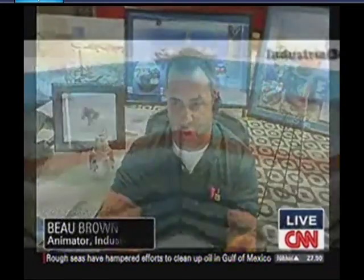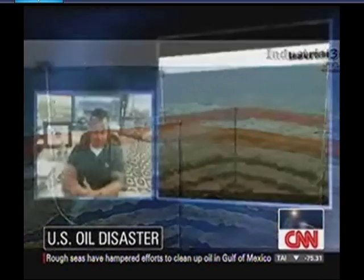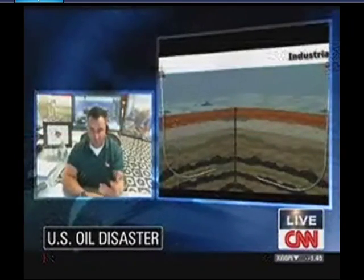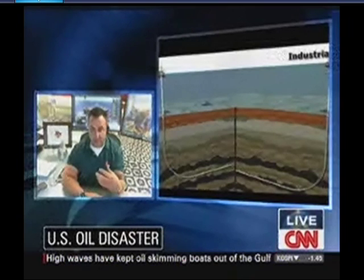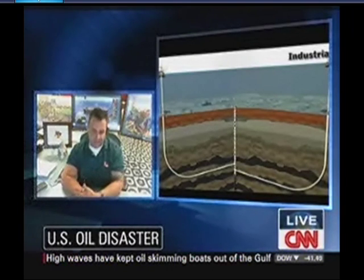Just describe what we're seeing here. Well, you're seeing the two relief wells — they're being redundant, they've got a backup, they're running two. Drilling a relief well is no different than drilling an original well, except you know about the formations and the subsurface hazards from the data collected from the Macondo well. One of the cons is you're trying to hit a specific target.